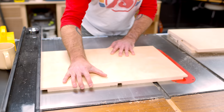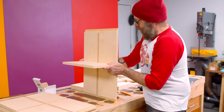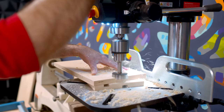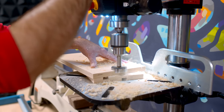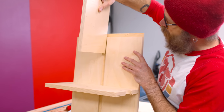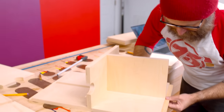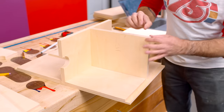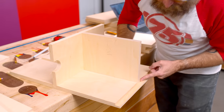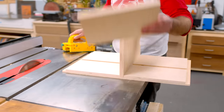Now that we have all of those cuts, this is the right side and this is the horizontal brace. The next thing I need to do is cut a little space for the tweeter, because the tweeter is going to go right there — so I just need to notch out the centerpiece. For the vertical braces, I cut them purposely too long so I could get the perfect fit, since they don't go into a dado on the top and bottom. I'm going to nibble away until I get the right fit.